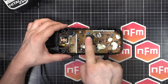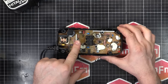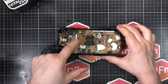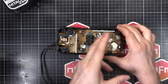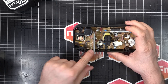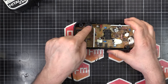Here we've got the switching transformer with the output diode — this is turning the high frequency AC from the transformer back into DC. Over here we've got our FET, a switching transistor which takes the rectified DC and turns it into high frequency AC so the voltage can be dropped down, goes through the diode, and we get our desired output voltage. We've got our fuse, which has also popped, a common mode choke to stop switching noise getting out into the mains, the bridge rectifier turning AC into DC, and a big smoothing capacitor.